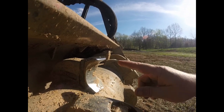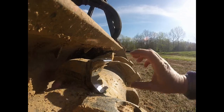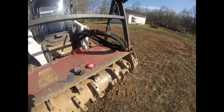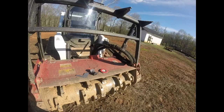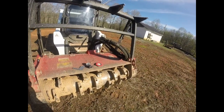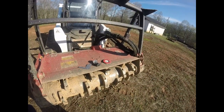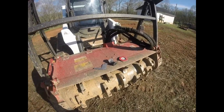I don't know how long it's going to take to sharpen — I've never sharpened before. I've got 10 teeth on here. So I will do that and continue to use these teeth until they're worn out. Hopefully after sharpening I get another 20 hours on this edge, then I could flip them and get another 40 hours on the other edge. But overall, if you're looking for production, the blade teeth are definitely higher production — roughly nine hours per acre compared to carbides taking about 11 hours for that high-density, large-wood situation. But now I'm going to have to do some maintenance, and I'll have to sit down with a piece of paper and a calculator to get the actual cost per hour.